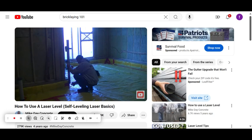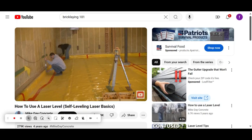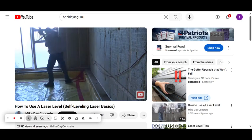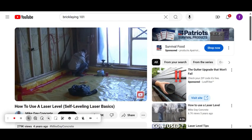I use this every day for concrete floors — I come in before we pour, get my grade all established, and then I can check the level of the sub-base by moving the receiver. That tells me just how thick the floor is going to be. We were shooting for a four-inch thick concrete floor in here, so we'll see what that turns out to be.